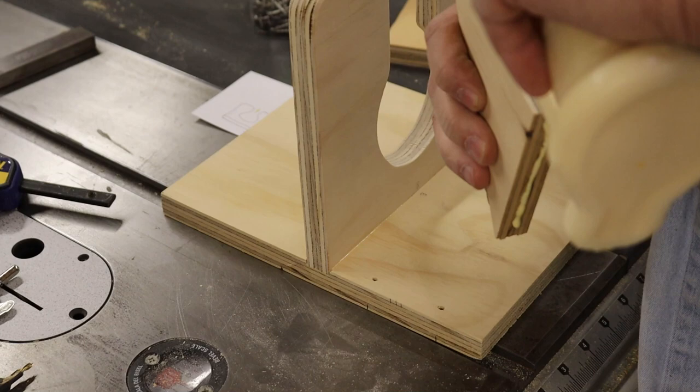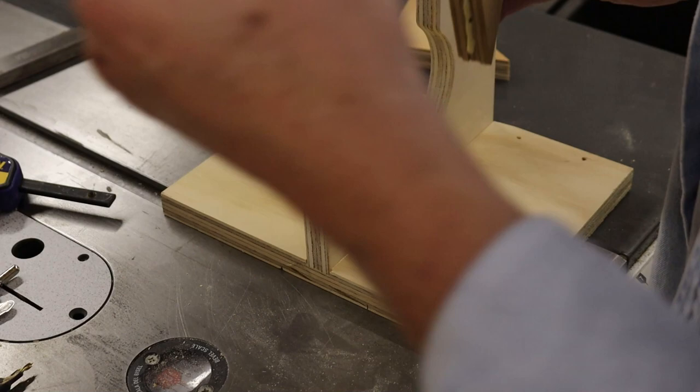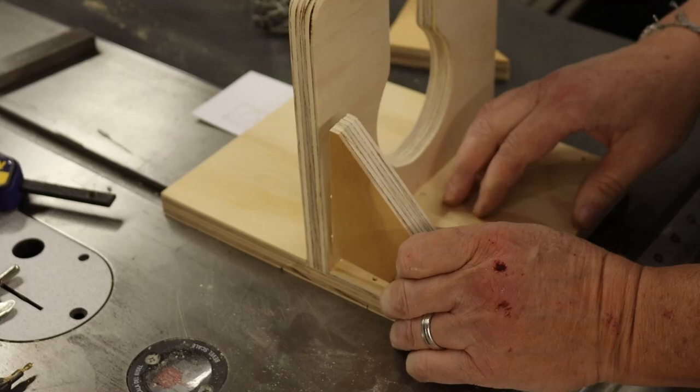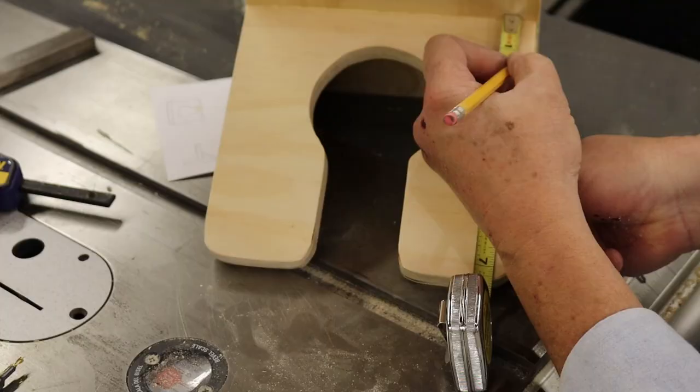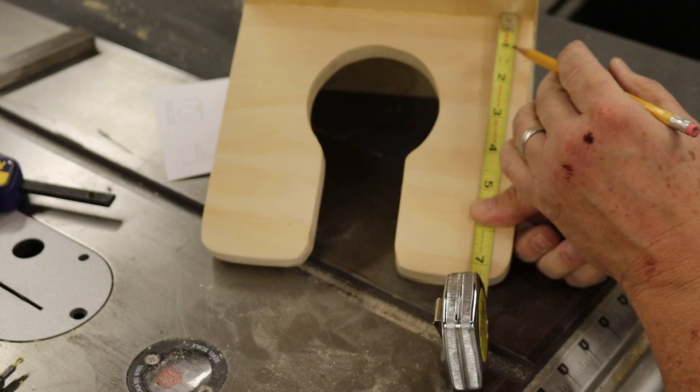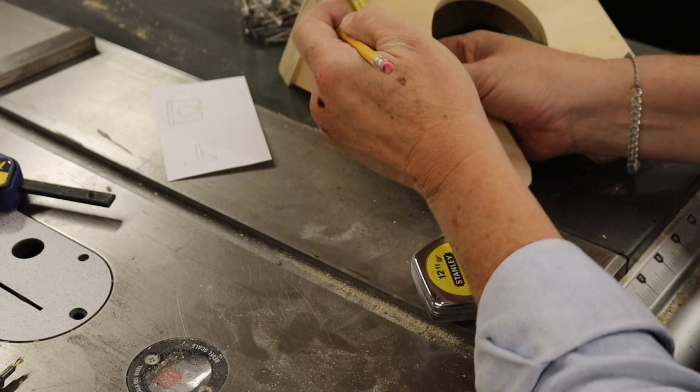The last thing I'll do is drill a couple of screws through the top of the weed eater support into the gussets. I'm going to come in an inch and a quarter from the back and an inch and a quarter from the front, so I'll put one at one-and-a-quarter and one at two-and-three-quarters on each side. I'll come in three-eighths because that's the center of three-quarter stock.